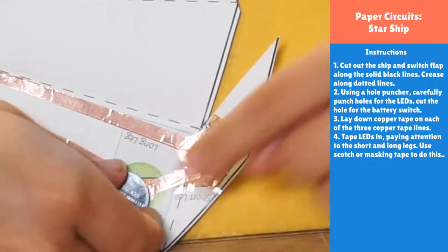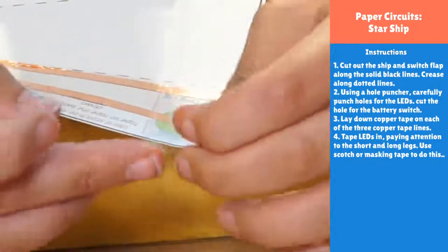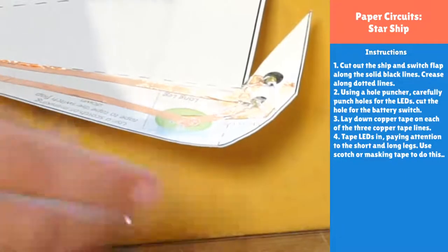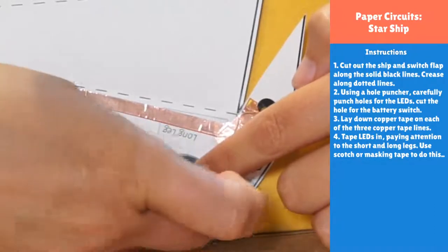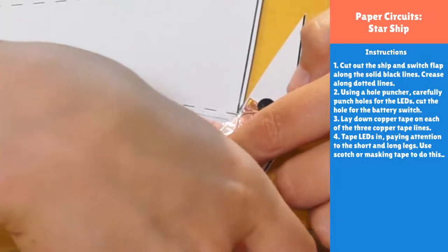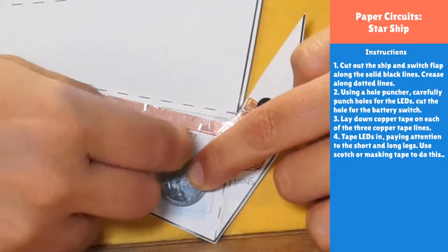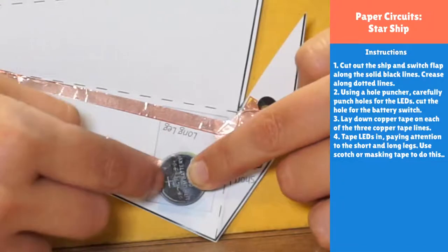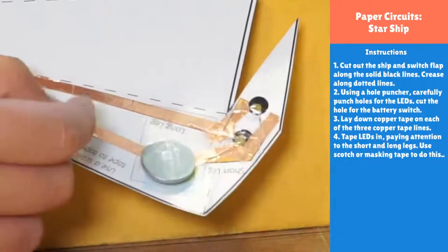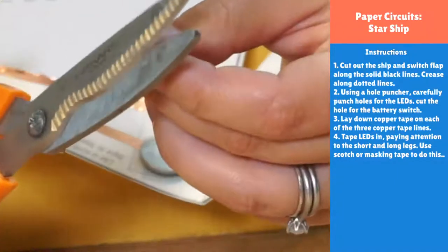We need to tape around the edges. And that's because this tape, remember, it acts like an insulator. So if I put tape all over the top, I can't get the electrons out to go run through those slides and light up the LED. We'll just be stuck there. So I can take some tape, and I have to go just around the edges so that the whole top, as much of the top as I can get, is open. All right.